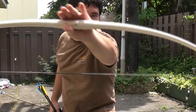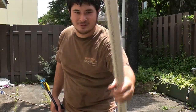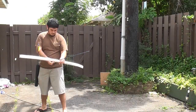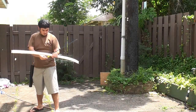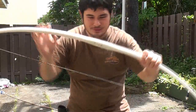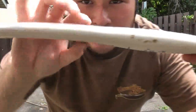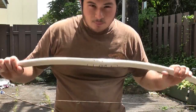Here's the bow — as you can see there's no evidence of the handle collapse that we had. This thing is ready to go. Now that we've done that fix, this bow will have a nice long life. If you're making a bow for the first time and using a flattening jig, just make sure the handle looks like this — you don't want any hard creases because that will cause the bow to collapse. More importantly, you don't want any burns. The next video I'm going to show you is what happens if you burn the pipe.